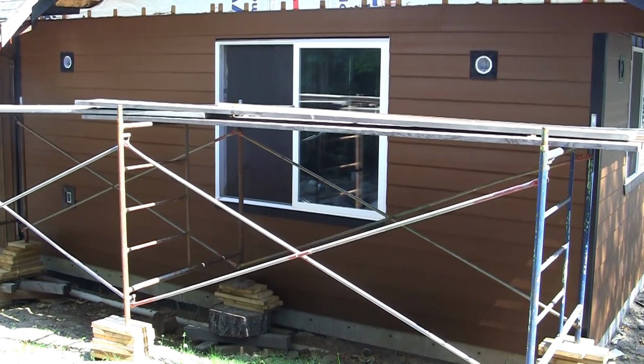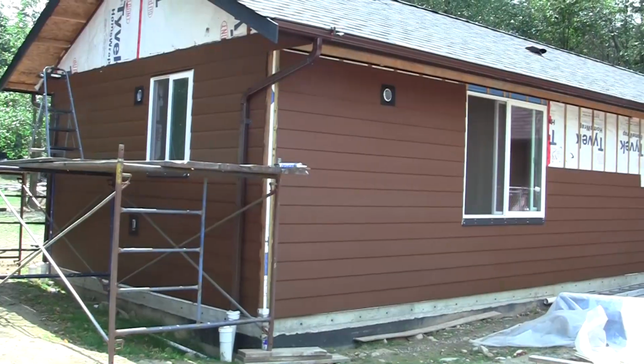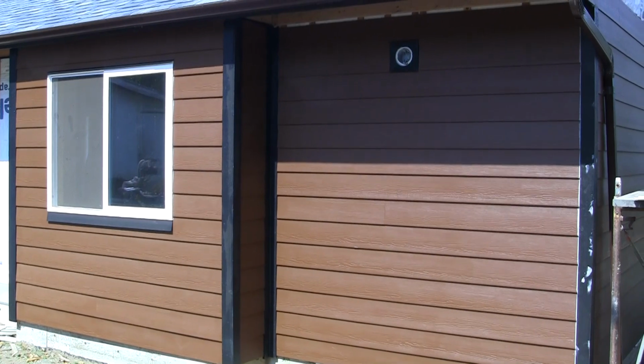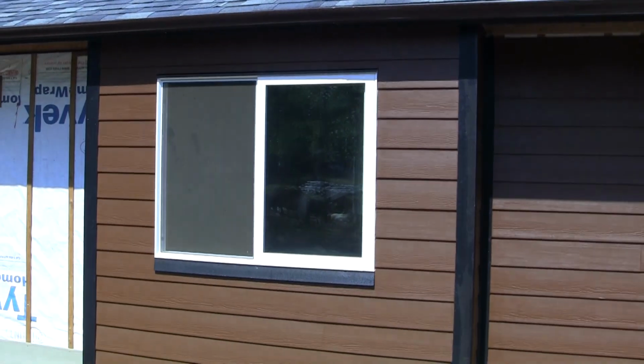Now I'm on the last of the cheap blades. I've done probably 50 or 60 cuts on it, probably more cuts than I had on the other two. One thing I did notice is that I had a lot of repetitive cutting, because I have all these pieces here that are exactly 12 1/4 inches long, so in the interest of getting the job done fast, I started stacking them as many as 3 and 4. So doing that, I quickly discovered it drastically reduces the performance of the blade. And I have to admit, I did stack at least 2 a couple of times with the fiber cement board, so not the end of the world. But I also did that with the wood blade and still got 40 cuts out of a dull blade.